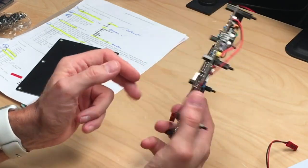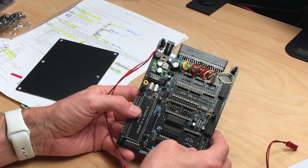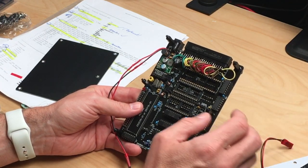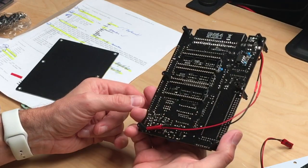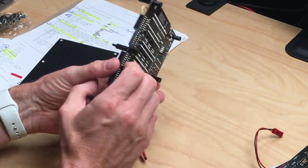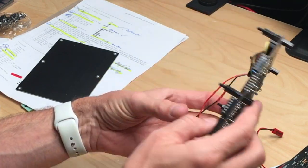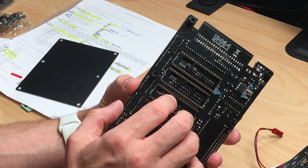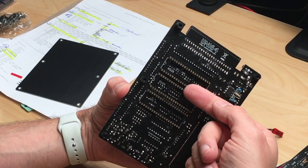There's one more part. That is that the ROM chips, so the kernel ROM, the basic ROM, and the character ROM, have to be combined into one single ROM. So you have to program your own EEPROM, and you don't use the standard C64 ROMs for that. I was pretty confident with the soldering, so there was one tricky part. You can see this here. You have to solder from both sides. So first you have to solder these, I guess, if I'm not completely mistaken, and then you solder the other sockets, and you have to solder them on top of each other. So we have to solder under the socket.